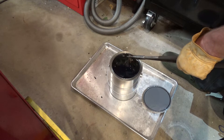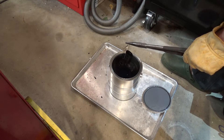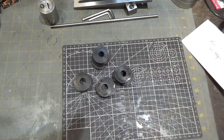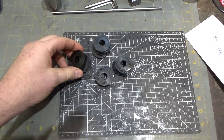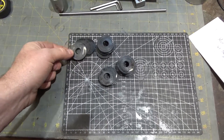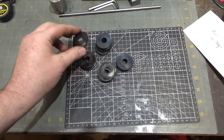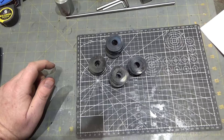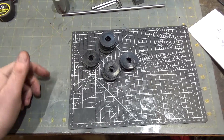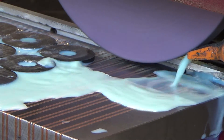All the oil is smoking like crazy. There's a ton of mill scale on these — I could have wrapped them in stainless steel foil, but since I'm going to surface grind them I didn't think I needed the wraps to reduce oxidation. They did get a ton of mill scale, and when I was handling them some of it was popping off. You can see some parts where they were in contact kept the oxygen away. The file just skates on them — they're really nice and hard. I was shooting for low 60s Rockwell, like 61 or 62. Now we're at the surface grinder cleaning up all the mill scale on the washers as a group, just trying to get through the oxide layer.